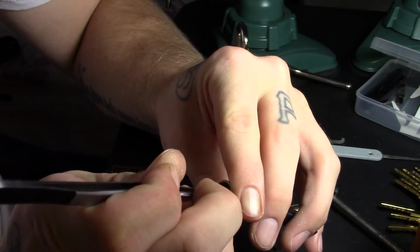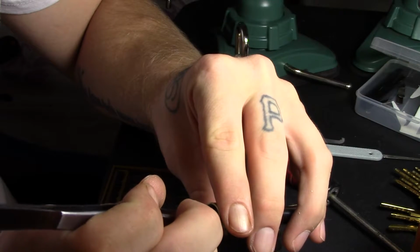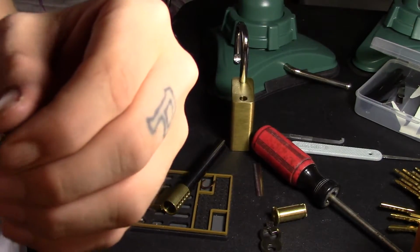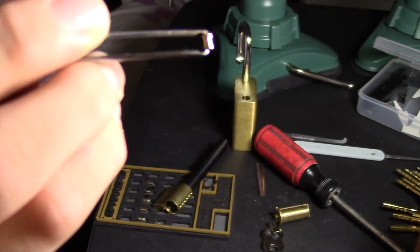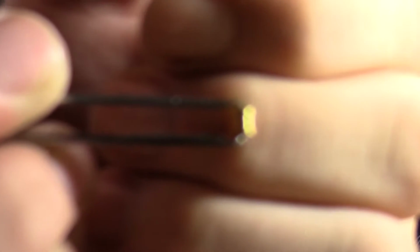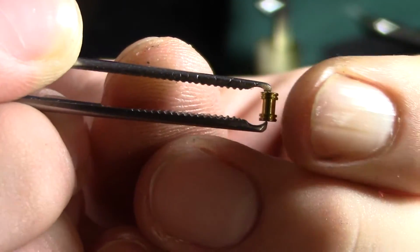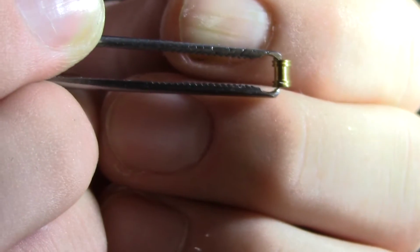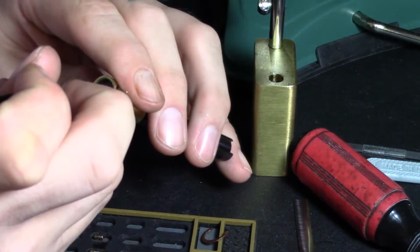Got to be a serrated spool in here somewhere. And look at that. First pin we have in here. Trying to grip it so I can show you. One of my favorite all-time pins. Come on, baby, focus. There it is. That is a serrated spool. If you look real close, you can see just light serrations on the top and the bottom of the spool. I love when I find them in regular size pins. But yeah, that's a serrated spool. Spot one. Driver pin one, I mean.